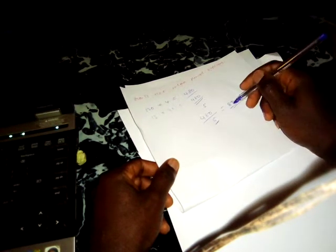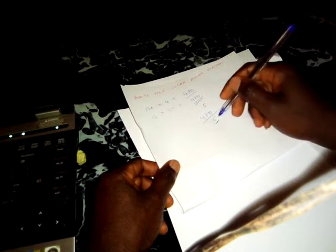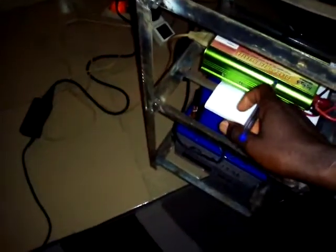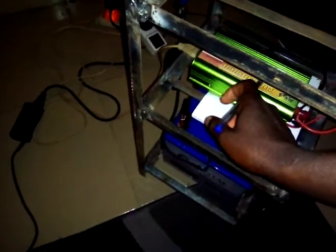That is how you size the system, and it's very important — if you don't know this, you'll just be doing trial and error and find your battery never gets fully charged. Output can also vary from dry season to rainy season. In dry season when the sun is at peak, you get the best results. The extra 2 hours of sunlight act as a buffer for days when the sun is not too bright. Please do not use a UPS — it will not give you the efficiency you're looking for. And if you're using this type of inverter, please do not use appliances that are electromagnetic — those that use a coil inside — because it can damage the inverter very quickly, as it is not designed to handle current flyback.